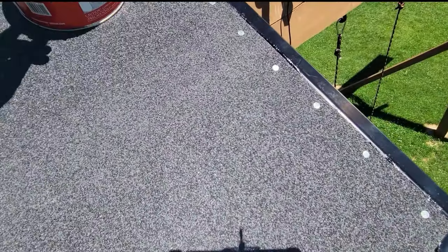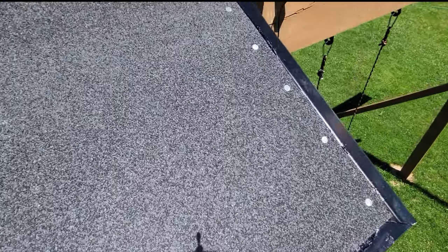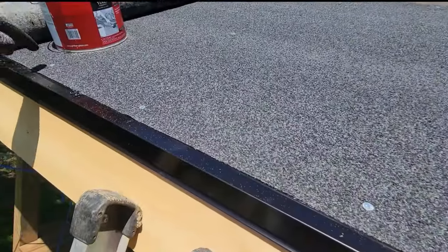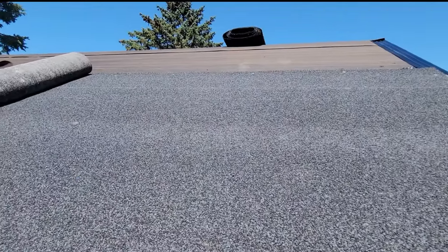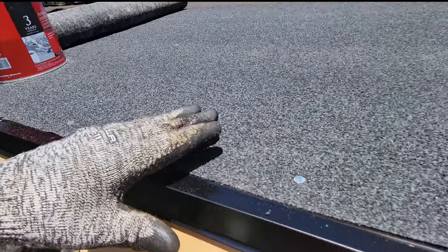So here's a rolled roofing edge — you got your drip edge installed. You do cement up the edge and nail it every 3 to 4 inches. These ones will be left exposed. Those ones up there will get covered by that next sheet. This is super nice stuff. Very happy with it — it's sticking in really good. So let's keep going.